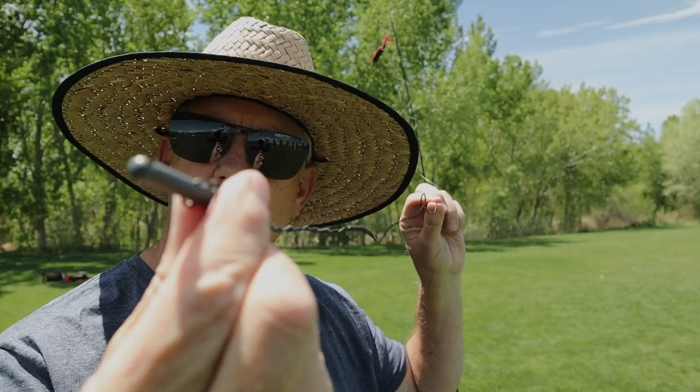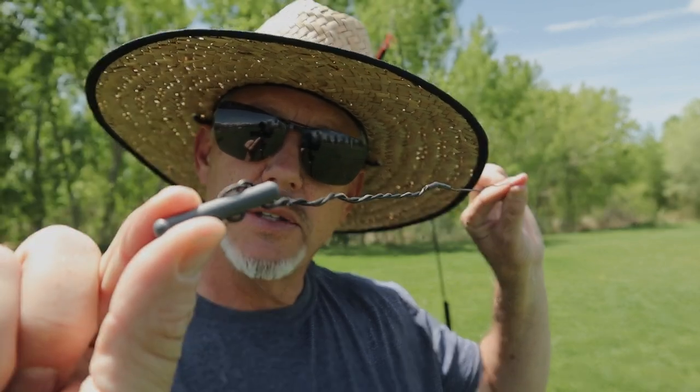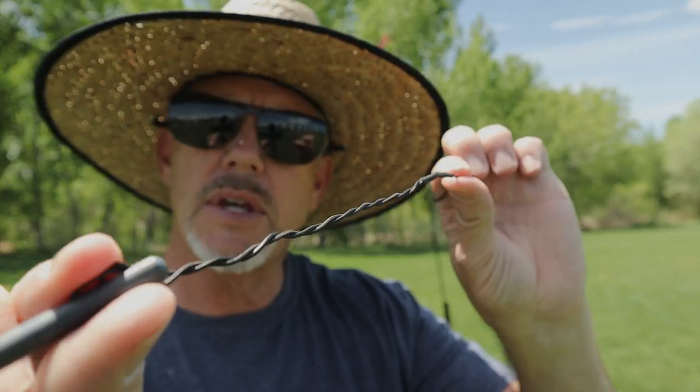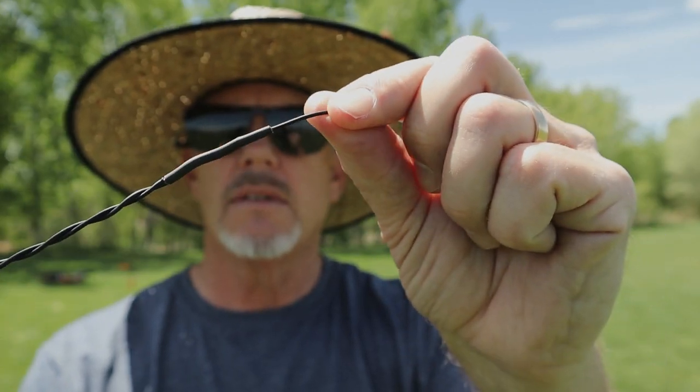For my last test I'm going to extend that loose dangling piece out farther into the field like an inverted V. I'll run some string through the hole in the insulator and pull it out. Before that, a tip: when you first tune the antenna you wind the wire around the center insulator and trim it until it's tuned at the lowest part of the 40-meter band. For the leftover wire, I wrapped it around itself. I used marine-grade heat shrink on the far end, but it's probably better not to — that way you can cut it later to readjust for a different part of the band.